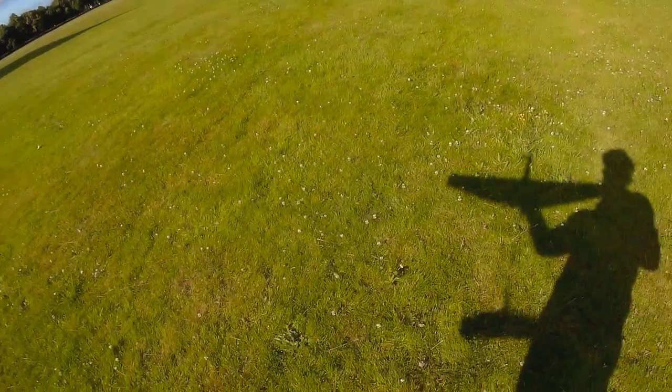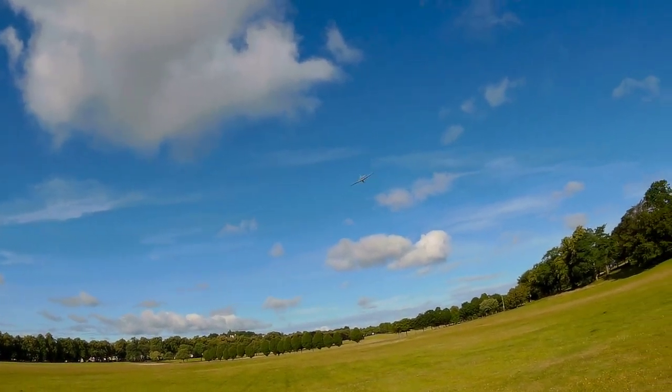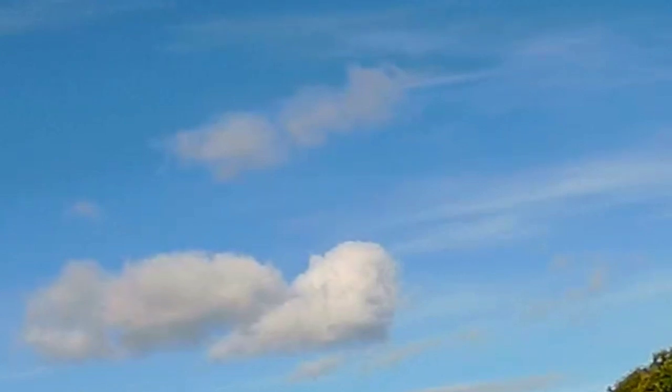With some altitude, let's see what kind of flying we could do with this Dragonfly. With a few adjustments to the COG, we launch again. One thing I notice is that it tends to climb with neutral sticks. If it were calm, I'd attempt some trim, but in these conditions, I don't want to fumble that, so I just keep the stick slightly above neutral.